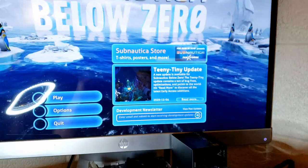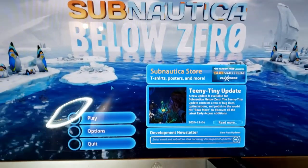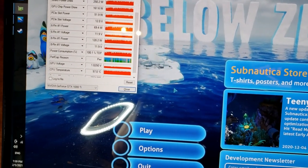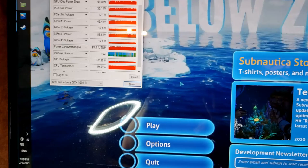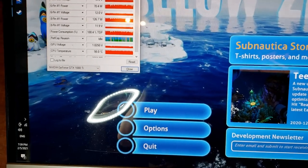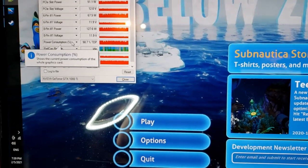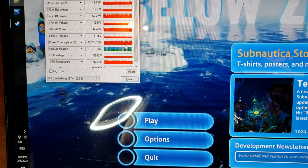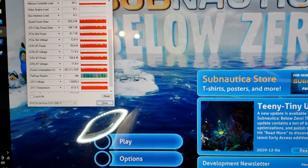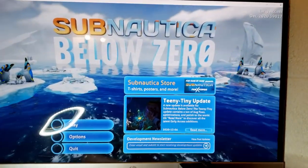I'm going to change this fuse to an inductor and load test the card. The card has been running a game for about two and a half hours, which I think is long enough. Looking at GPU-Z — when you stress test GPU and memory VRMs, you want to make sure it's been done for an extended period and at about 100% TDP, which is full load at the expected maximum power consumption. This stresses the GPU VRMs to confirm the repair job was good and nothing else is wrong. In this case it looks perfectly good. I'm going to go ahead and say the card is repaired.